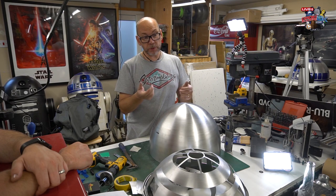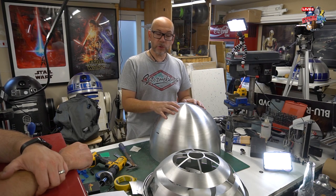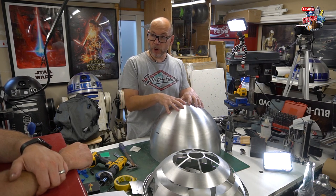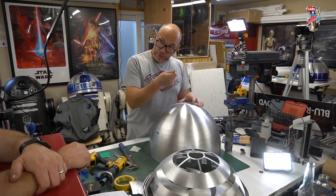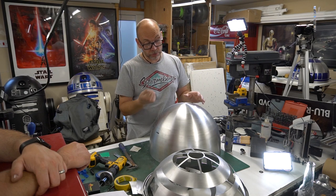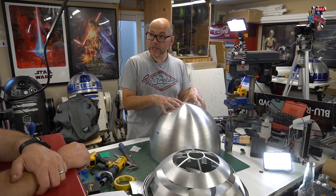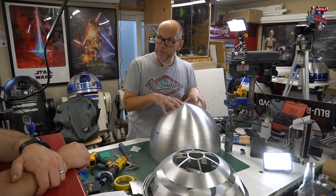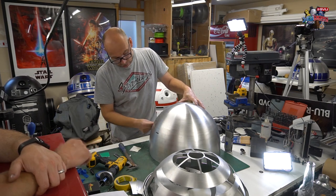But with silicone, leave the nozzle nice and small. And if you don't use too much, you can get a screwdriver underneath it and remove the panels at a later date. So if you build it and don't have opening panels and decide you want to at a later date, you can then easily just carefully prise the panels off. And then do your cutting, which I'm going to show you some Dremel cutting in a minute, and cut your panel so you can have the opening panel. So personally, silicone. I think the 3M tape is a bit more permanent though, isn't it? Yeah. So I'll be using silicone, mastic, whatever.